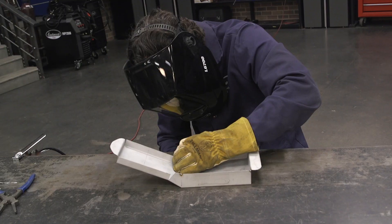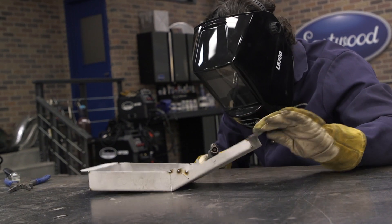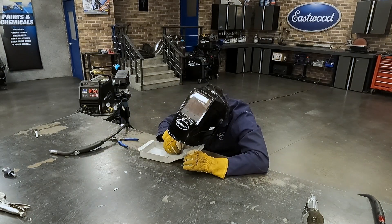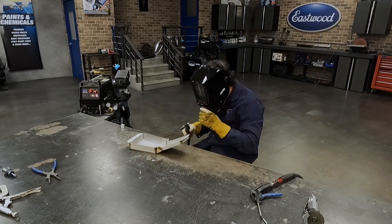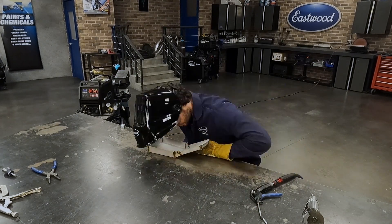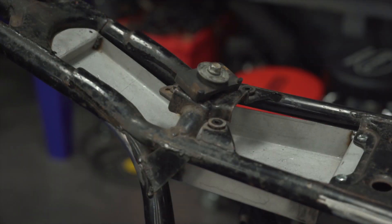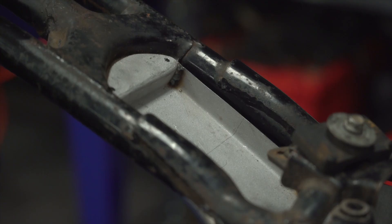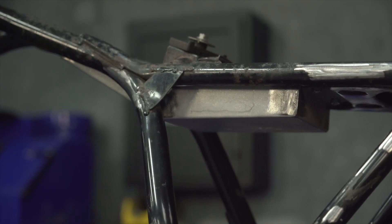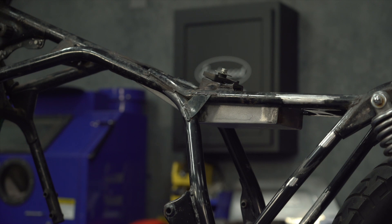When it comes to welding thin sheet metal, you do want to be careful, especially on a project like this one where you've spent hours getting everything bent and ready to go. What you want to do is tack everything, make sure nothing moves on you, use some compressed air to cool it down in between welds, make sure your settings are right, and then MIG is just point and shoot. Go around slowly and make sure there's no warpage until the full thing is welded. I think this thing turned out great — there's plenty of space in the tray itself, especially on that diagonal portion that follows the front of the frame. I think this is more than enough for all my electrical components, and I might even be able to fit the battery in there.